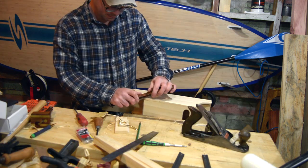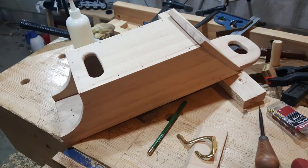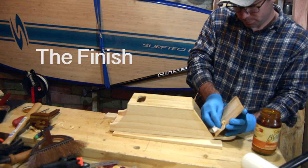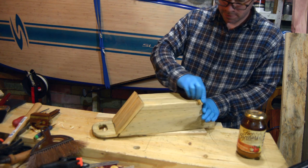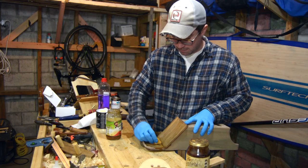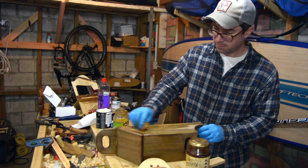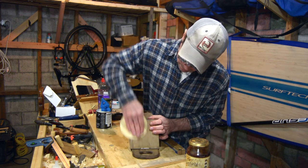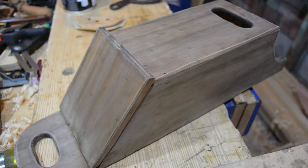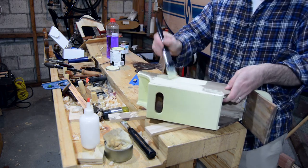I think this box looks pretty good as is, but I wanted it to look rustic, so the first thing to do is stress it a bit. I did it the easy way using my spokeshave and sandpaper. These rustic country style finishes can be achieved pretty easily — you just have to remember you've got to do lots of layers. Here I'm starting off with my old go-to of steel wool and vinegar. That's going to take a while to dry, but after that I'm going to apply a sanding sealer. Here I'm using a really thin shellac. And then I'm just going to sand that smooth.